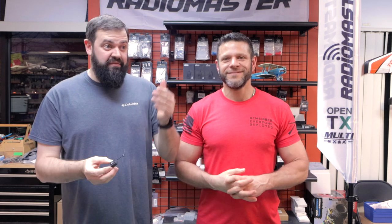We're changing the mapping so that one receiver handles channels 1 through 5 and the other handles 6 through 10. You could also mix and match — like channels 1, 3, 5, 7 on one receiver depending on how it's mounted on the fuselage. Make sure you hit that subscribe button so you'll be first to know when we release that video. Hopefully we'll have a big screen so you can see what we're clicking.